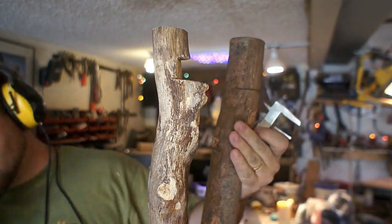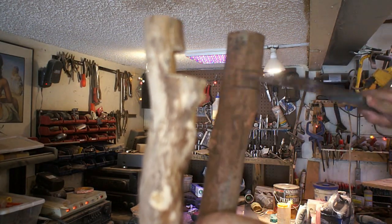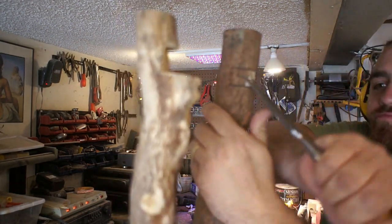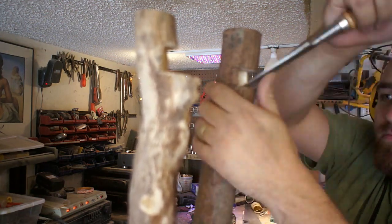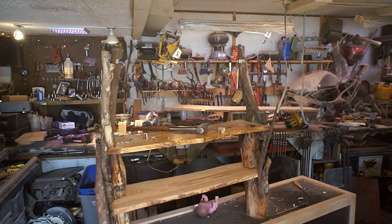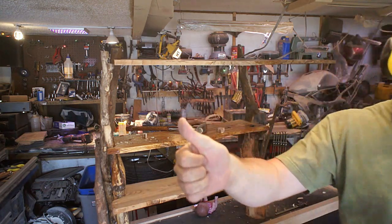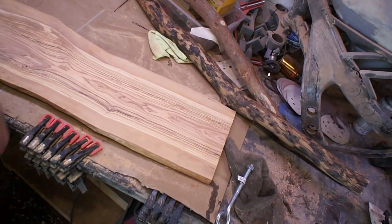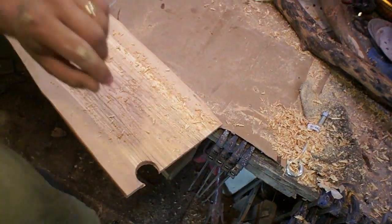I had these calipers set to the height of the wood that was going to be sliding in there, just so I knew exactly how much material I had to remove. After a test fit it all looked level and lined up right, and it was time to start making the supports for the right side. I'm coming in again with a Forstner bit to remove the bulk of the material for those uprights, then grabbing a saw to get the edges cut off.